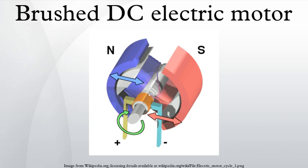There is a second problem with this simple pole design. At the zero torque position, both commutator brushes are touching both commutator plates, resulting in a short circuit. The power leads are shorted together through the commutator plates, and the coil is also short-circuited through both brushes. Note that this problem is independent of the non-starting problem above. Even if there were a high current in the coil at this position, there would still be zero torque. The problem here is that this short uselessly consumes power without producing any motion.